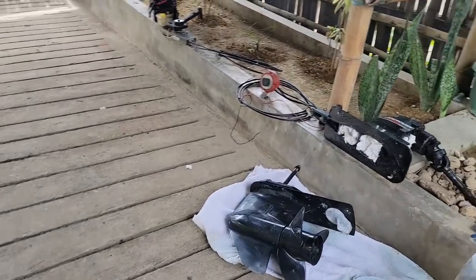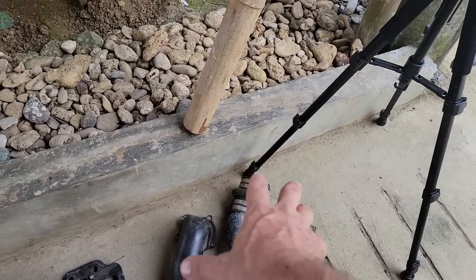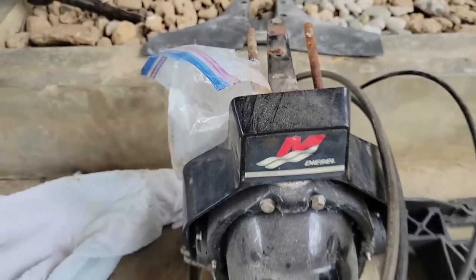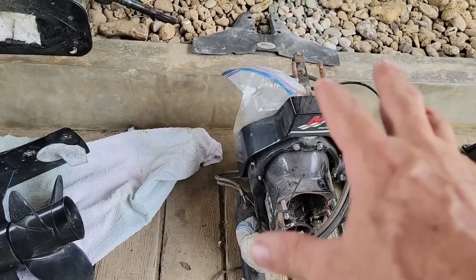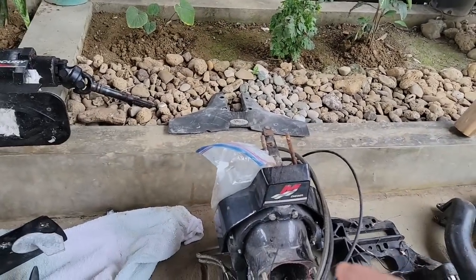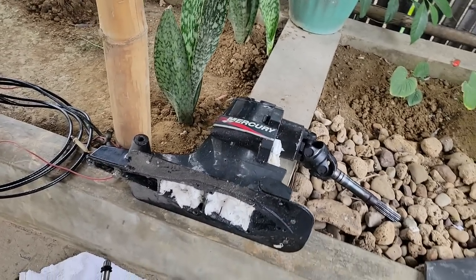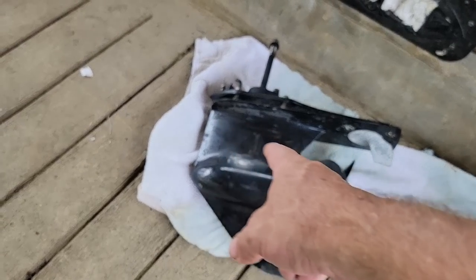Here are some of the parts I shipped from the U.S. for the Mercruiser. We've got the exhaust tubes right here, we've got the transom plate — we'll come back and talk about that — and we've got the out drive unit right here. As you can see, this is Mercury diesel. Everything's set up heavier. Now in this particular unit, I haven't researched yet whether there's any difference between this housing and the one already in there. But I do know this unit has a different gear ratio, different bearings for the diesel's torque, and this prop on the lower unit is pitched differently with likely stronger gears.